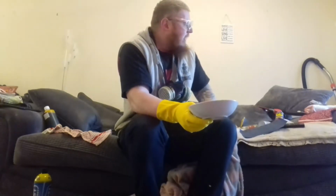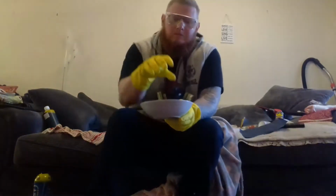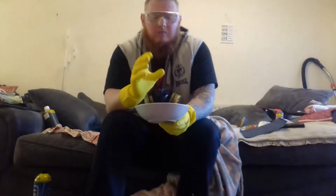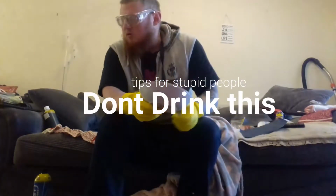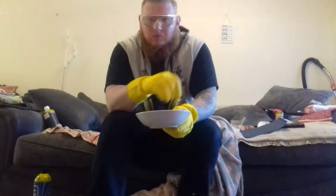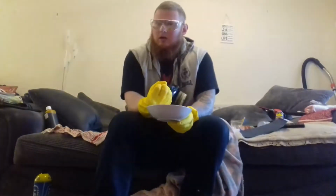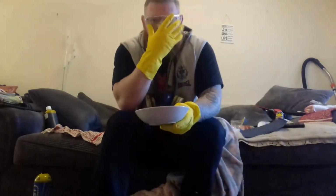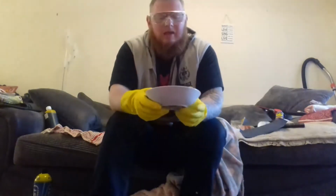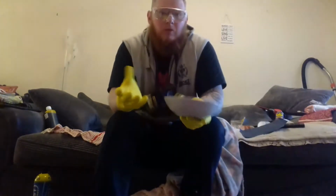Now what you must do, and this is very important, is make a 50-50 mix of white vinegar, which is here, and this ferric chloride. You put the white vinegar in first, that's the most important bit. You do not, under any circumstances, put ferric chloride in first, because you can get a splashback if you put them in the wrong way around, and you don't want to get it all over you, because even though it's not going to probably burn you or damage you, the last thing you want is to get it into your eye and cause a little bit of damage. We are treating it as a strong acid, even though it's a very weak acid. We are treating it as a proper acid.